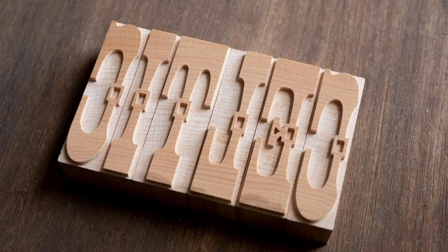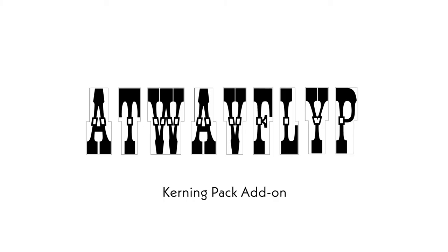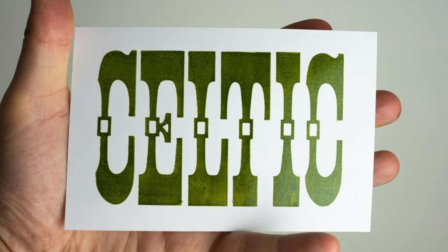Many of the historic typefaces out there have letters prone to certain issues. Cutting slots into the problem letters means they can fit together with the right spacing. I've also taken into consideration the space that is left over — this space can be filled perfectly with Anglo spacers. For this one, 30-point spacers on either side returns the block to normal.